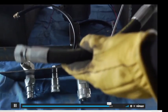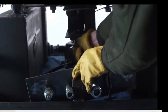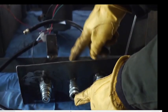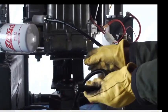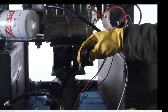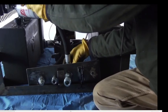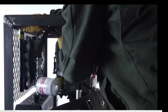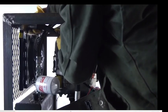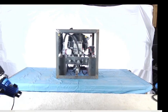Make it really transparent and simple. You can connect your hoses quickly, and these don't reverse. One is always power and the other one is always return. This is not bi-directional. There's one power side and one return side. Whereas on cylinders and motors, if they're bi-directional, they could take power through either outlet. So a different solenoid later in the system redirects the liquid to push it back. Yep. A different valve, either a manual valve or a solenoid valve, would redirect it in both directions. The bidirectional valves, you can run them in two directions.